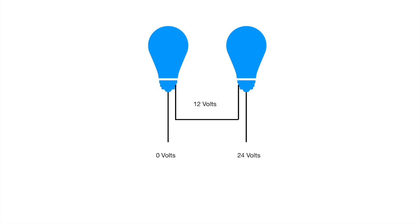Let's get to work. These light fixtures are 24-volt and they're bi-directional so the bulb can go in either way, and it's very difficult to find an LED bulb that will fit in these light sockets. So what we're going to do is change these out to get a cheap LED bulb that will fit inside these — that's a cheap way of making these fixtures LED. You don't really want to throw these fixtures away; the fixtures look fine, it's just that we can't use that particular bulb anymore.